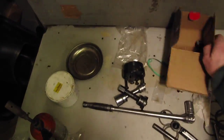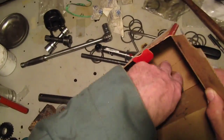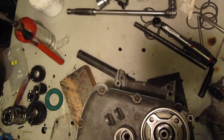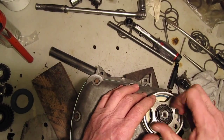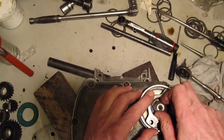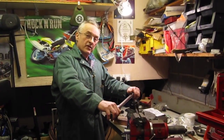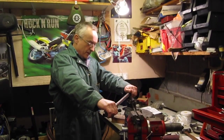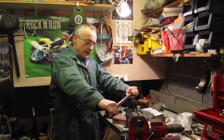Just sitting that on there. Note which way around the seal goes on these — it's not the way you'd expect it to be. Just going to torque up this output shaft flange nut, and it's going to be done up to 220 Newton meters.